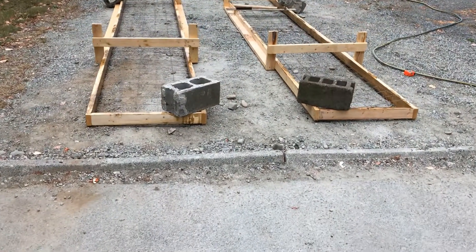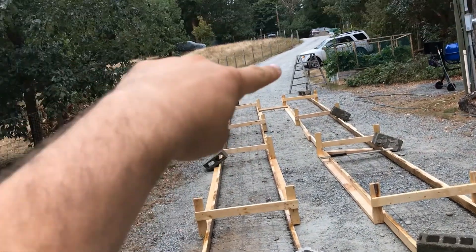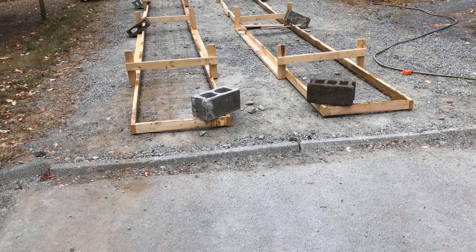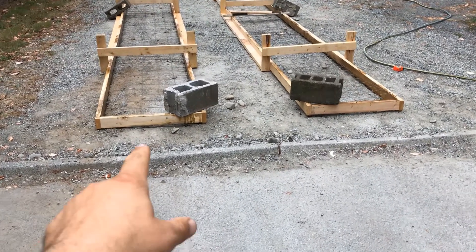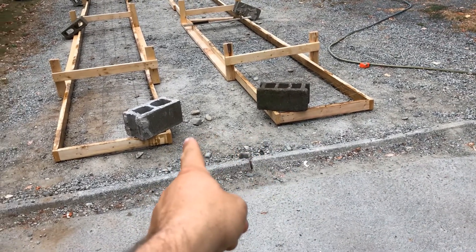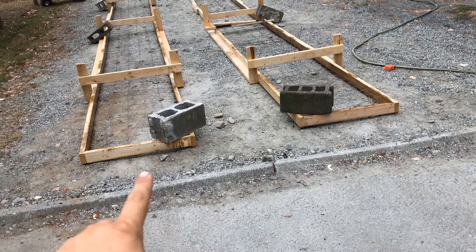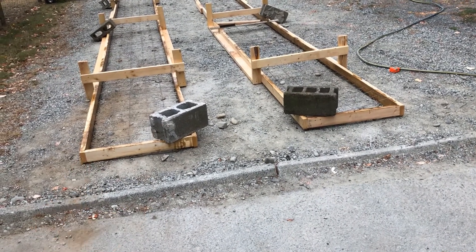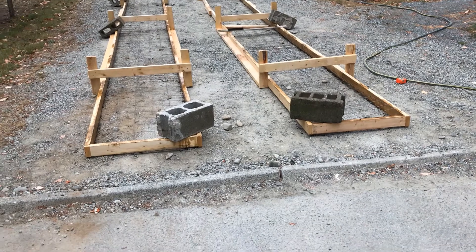This is the forms we've made for ribbon lanes. We have 375 feet of driveway that goes to the road, and it's too expensive to pave it all or put concrete through the whole thing, so we decided to do ribbon lanes. There's 36 inches — 3 feet — in between, and each lane is 30 inches wide. Many suggestions were 24-inch minimum, but we wanted to go with 30. We measured it against a little Yaris and a full-size 1-ton diesel, and it gives lots of space.